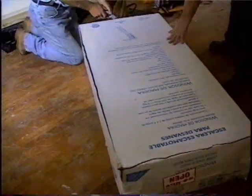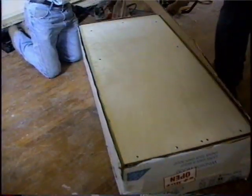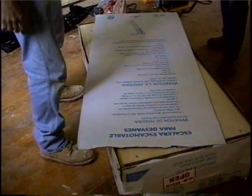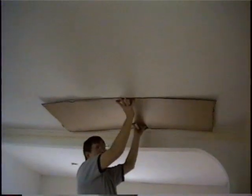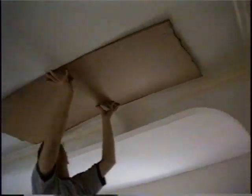You want to cut right along that crease because that's the actual size of the hole that you want. And there we go. What we'll do is put this on the ceiling where we want to add the attic stair. Now as you can see up there — we're going to tack it up — that's where our attic stair is going to go. The nice thing about it is that we can move it around to where it looks the best. Like I was showing you in the attic, that wall with the header is our roof jack, which means it's our bearing wall, so we want to stay away from that. We're going to put it right there.